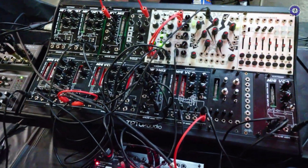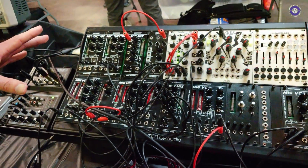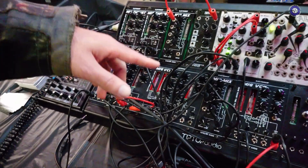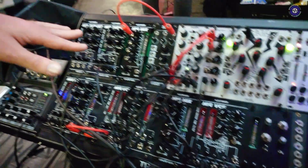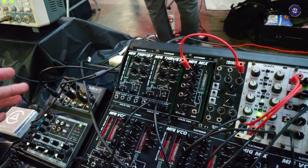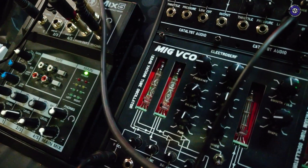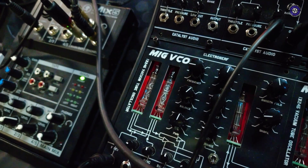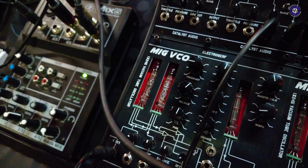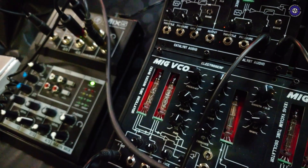It's quite nice to be here and we're going to look at your MiG series vacuum tube modules, right? Yes. So, this is a whole series of modules — a VCO, mixer, VCF, VCA, and a noise source. All of these modules are designed around new old stock tubes that were originally used in Soviet fighter jets from the 80s, hence the MiG name. So, how did you come across the stock of these old tubes?